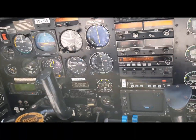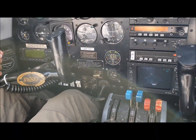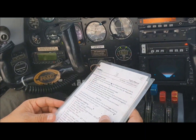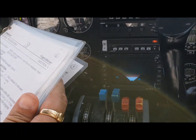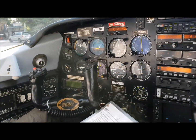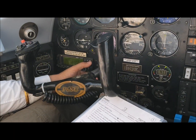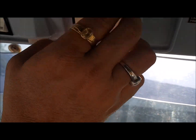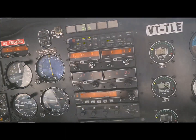Make sure the door is closed and do a quick run-up. Grab the checklist and do the run-up with propeller on and engine on. Weather radar is starting up. Now we go to the next checklist: battery is on, alternator is on, anti-collision light is on, GPS is on and powered up. Auxiliary fuel pump is on. The engine signal panel shows all the lights — everything is working, auxiliary pumps are on.